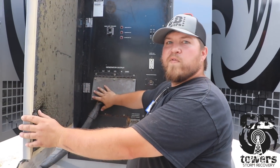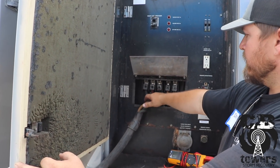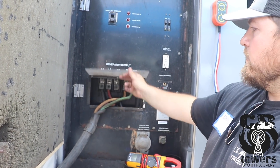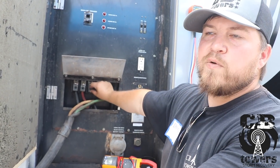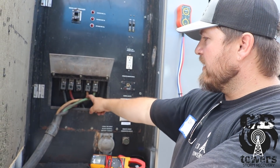First thing I like to do, come over here and check your power panel — make sure everything is wired up correctly. You got your black wire on leg one, red wire on leg two. Leg three will not have anything because it's for three phase; the stuff we do will only be single phase. Then you got your neutral and your ground. It's important to make sure all this is hooked up correctly.